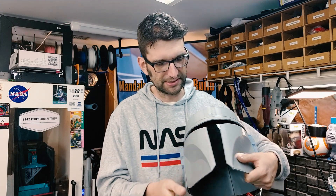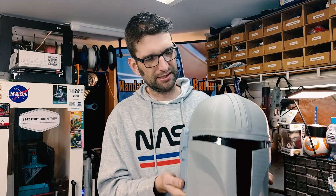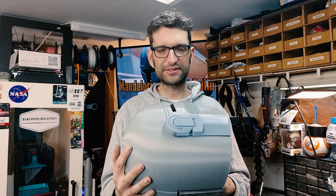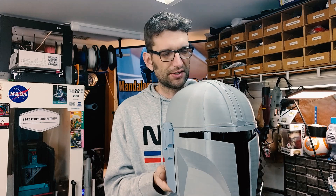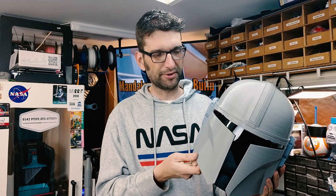Looking at the print overall, it's very clean and the model didn't move around. Sean did a couple really nice things when he modeled this fourth version — he put a little cross brace underneath where the visor goes. My problem with the first one was that the mandibles really flexed back and forth a lot while printing, so I got a lot of waves in the sidewalls. There's still a little bit of that; I think my CR-10 could use a little tuning. But overall the print is really nice, and I don't have a ton of cleanup to do — I'm going to take you through the process from a fresh print to a finished product.